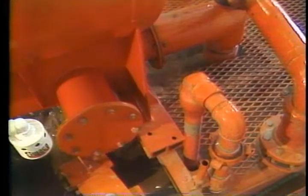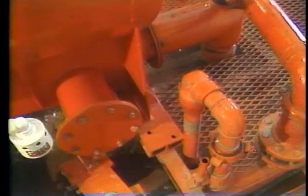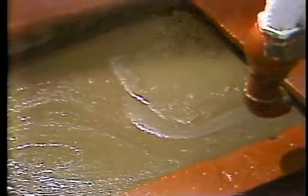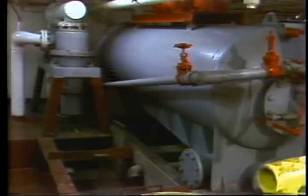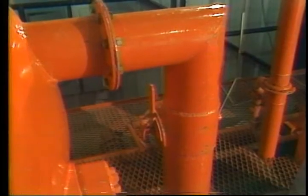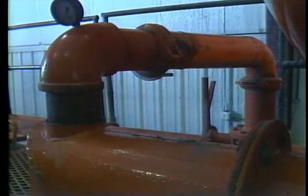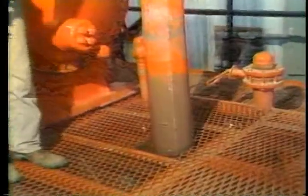If your degasser is not leaving the mud gas-free, it's probably due to the following. If too little mud is being treated, try increasing the pressure on the jet nozzle — if that doesn't help, the nozzle is probably partly plugged, so clean it out. If the opposite is happening and the degasser is pulling more mud than is being circulated, reduce the flow to the nozzle, or if that can't be done, partially close the butterfly valve in the suction line. If you find that air is being pulled into the system, check for leaks in the pump packing or in the discharge line from the degasser to the jet. Make sure air is not being picked up at the suction or discharge pipe — if it is, increase the mud level in the pit or lengthen the discharge or suction line.